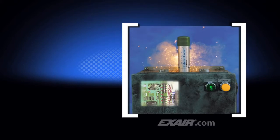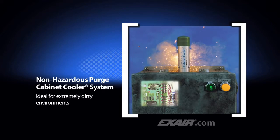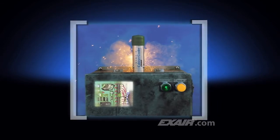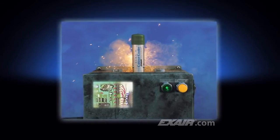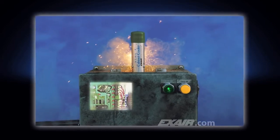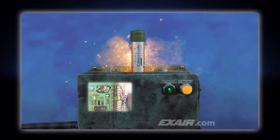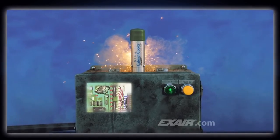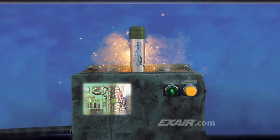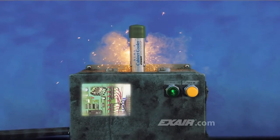EXAIR manufactures special cabinet coolers suited to specific environmental requirements. The non-hazardous purge cabinet cooler systems are ideal for dirty areas where contaminants might normally pass through small holes or conduits. Under normal conditions, the NHP cabinet cooler systems provide a slight positive pressure in the enclosure. They pass 1 SCFM or 28 SLPM of air through the cooler when the solenoid valve is in the closed position. When the thermostat detects high temperature, it energizes a solenoid valve to pass full line pressure to the cabinet cooler, giving it its full cooling capability.